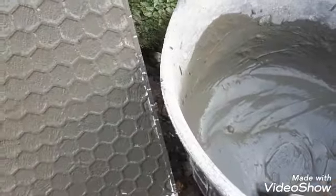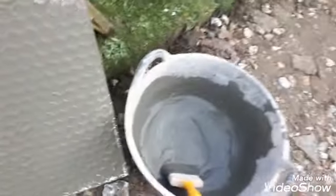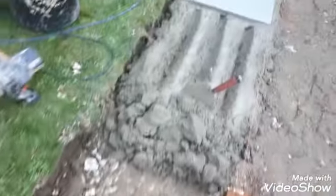This is the application of priming slurry to the back of the tile. Because if you don't prime it, the tiles will probably pop off the adhesive — they will not bond properly.